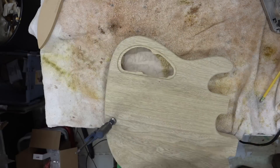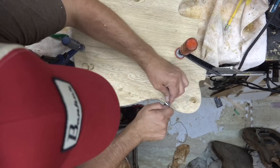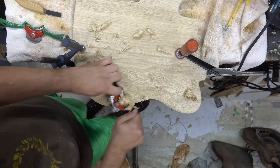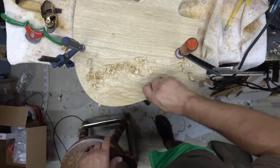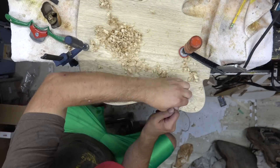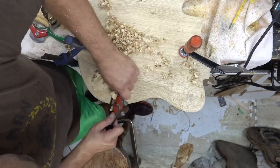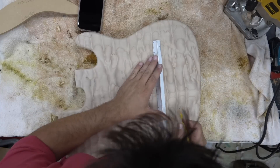We're going to add a little bit of a belly cut, and we'll come back with a bunch of different tools to do that. This is a spokeshave — and a smaller spokeshave. This is why I didn't drill any holes towards the belly; I was going to lighten it up this way. We've got a little bit of an Ibex plane — on Korina this works pretty fast. This body is too tall to take to the bandsaw, so I have to do it by hand. The Ibex plane takes it off in a bunch of different spots, the spokeshave levels it out, and then I'll come back with a sander.